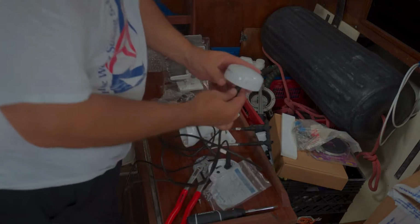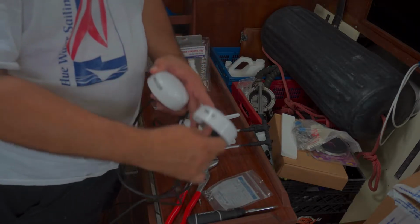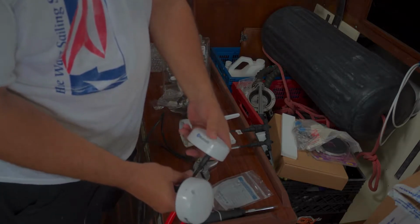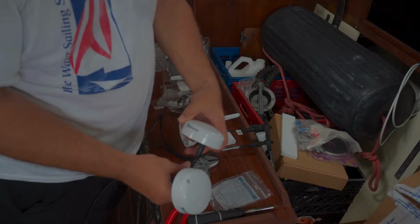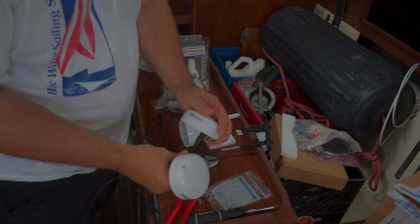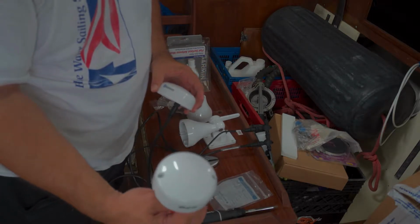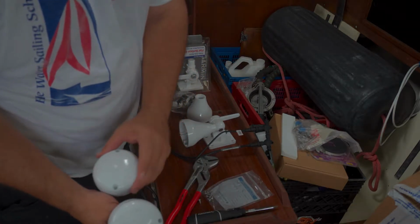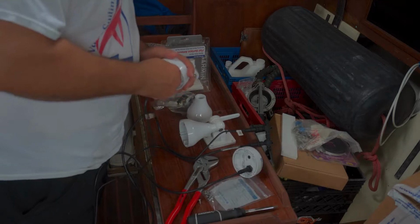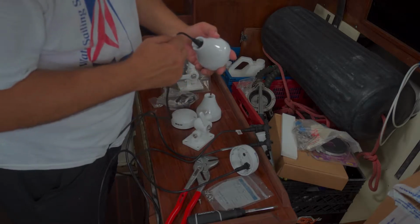So as I mentioned before, I bought B&G for my electronics. You can see right there, this is the WS320. This is a Bluetooth puck, and it provides the wireless service for the wind vane, or wind anemometer. I'm probably saying that word wrong. That's up at the top of the mast, and this provides the GPS. So they have an arrow, basically which way I need to point them, to point forward. So I'm going to take them apart, basically remove the cable, insert the cable.